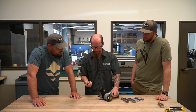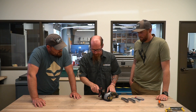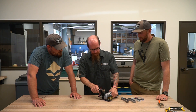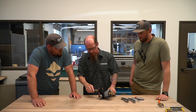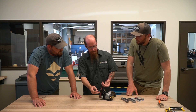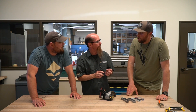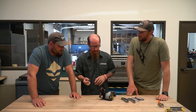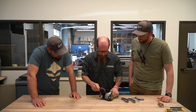What we're going to do is what we call place, power, and pull. We're going to lay the knife in on the belt without it running, put it up against the guide, and then as soon as I power the machine we're going to start pulling it through and stop at the midway point of the belt. If you pull it straight through, the back side of the belt is no longer supported — it'll want to turn and you run the risk of rounding the tip off your knife. Place, power, pull, and stop in the middle of the belt.